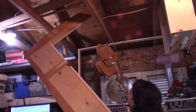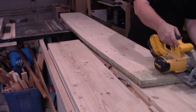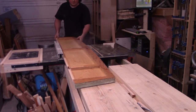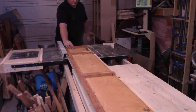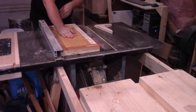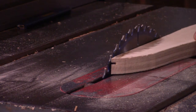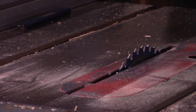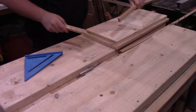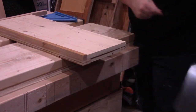Basically, I just need the material. The kitchen is getting a new laminate veneer throughout, so I don't have to worry as much about making it look perfect. This was the old eating bar my aunt removed — while I didn't need all of it, it was already close to the width I needed, and the thickness would match what was already there. So I ripped off the short side of the L with the circular saw, ran it through the table saw to get rid of the rounded edge, and then again to get it the final width. Then at the miter saw, I cut the countertop to final length, filled in the two missing sides of the bottom with some scrap plywood, and took one more pass through the table saw to clean up the edges. Since the original countertops all had an exposed oak quarter inch chamfer on the top edge, I needed to replicate that. Using the width of my push stick as a depth — because why not — I cut out a three quarter inch rabbet along the front and outside edge of the countertop, cut some salvaged oak to the same size, cut a 45 degree miter in the oak, and glued and pinned it into place. Then I cut off the excess with my pull saw and set the countertop aside while the glue dries.